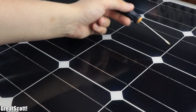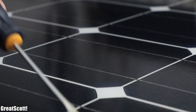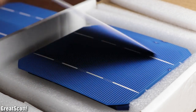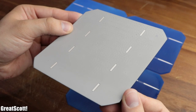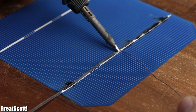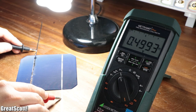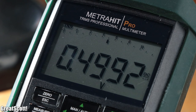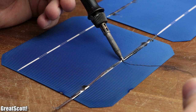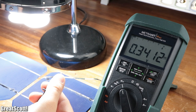If we have a closer look at this 100W solar panel, we can see that it consists of individual solar cells. Those basically make up all commercially available solar panels, and you can buy such cells online as well. After soldering a tap wire to the front as the minus terminal and the back as the plus terminal, we can use a multimeter to measure a voltage of around 0.5V when light hits the cell's surface. That is pretty much the maximum output voltage of one cell, which is why a solar panel connects many of those cells in series in order to increase the output voltage.